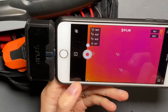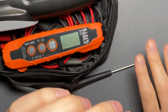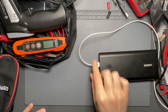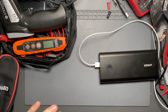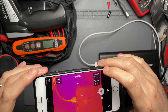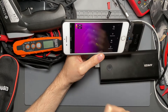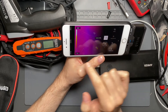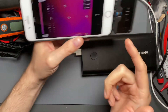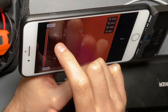The last thing to discuss is camera settings. I've seen videos where someone demonstrates how hot something is and it looks alarming on the thermal camera. Here I'm looking at a Powercore Plus battery pack charging a camera — it's not really warm at all, close to fully charged. But when I bring the camera over it, it lights up like it's really bright and you might think it's dangerous. What I find very useful is to go to manual mode and expand the temperature range. For instance, let's set the range to 40 degrees on the high end and 15 degrees on the low end.